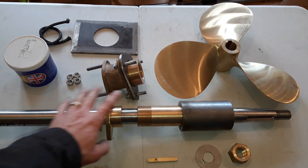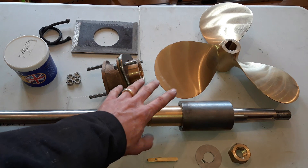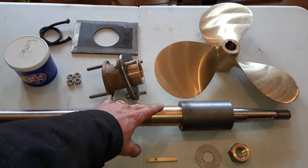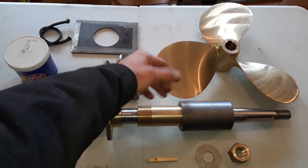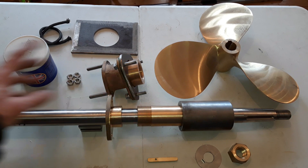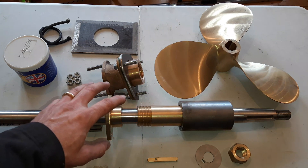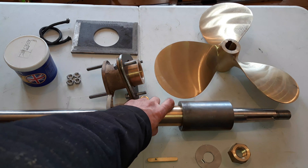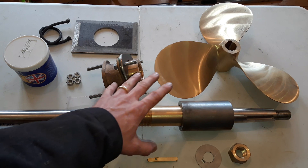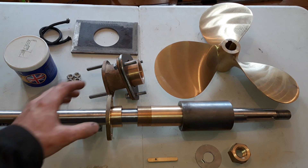A softer cutlass bearing is neoprene — the shaft floats on a film of water while the prop's spinning, which is a fabulous piece of kit, but not very resilient to shallow water and contamination. My preferred preference is this old system. If you get a car tyre, a mattress, or debris on the prop, you're going to get damage. You've got a lot of power being delivered to a propeller, especially when you chuck it in reverse to slow down. You can bend your shaft and damage your propeller blade. With a physical solid support, the shaft is less likely to take an impact.